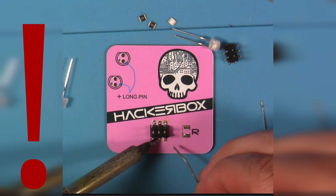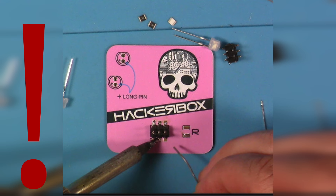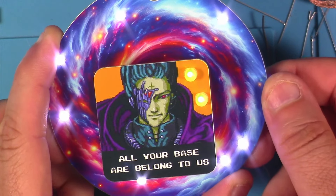I'm coming back after the fact to stick this warning in here: notice how these are surface mount and not through-hole connections with the SAO, and you just have these headers. No matter how great of a job you do soldering, if these are super tight — and they usually are when new — they will rip the traces right off of that SAO. Keep that in mind when removing them from a badge. If it feels like it's not coming out, reach in and actually get a hold of the connector itself and pull, instead of accidentally pulling the board off the connector. You can try working these header pins in and out several times to loosen things up just a tad. Gave this one a quick test and it looks good.